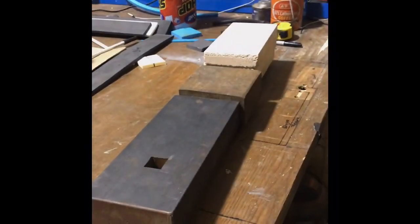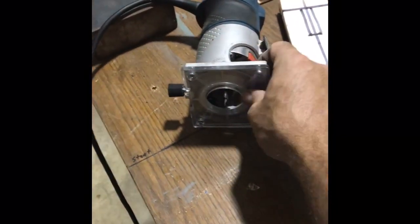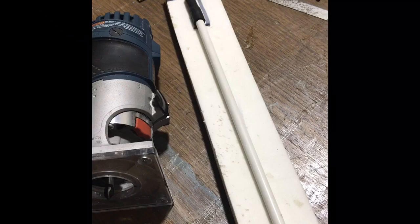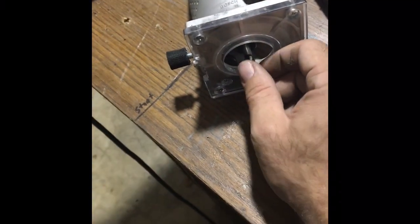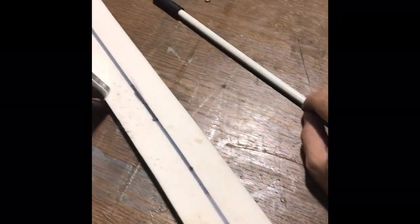The next step is to either cut, or in my case I'm going to route a channel here in the middle for my rod. I'll mark this spot up here to accept that a lot better. The blade I have here is a 3/8ths rounding bit. A 3/8ths straight will work, but this has a real round curve to it and I've found it just snugs that — another trick I learned from Steven Scroll. That round bit — you can see that's the exact diameter of this rod. That 3/8ths is the exact diameter of this rod.